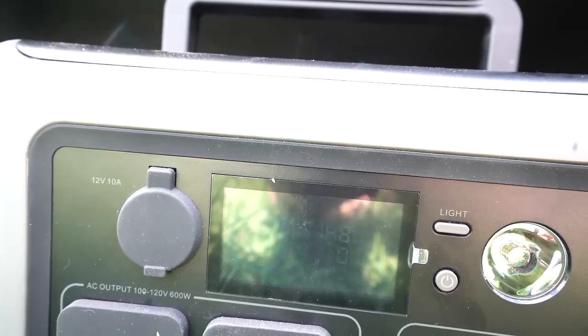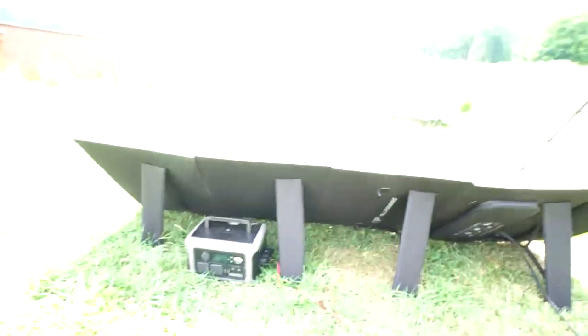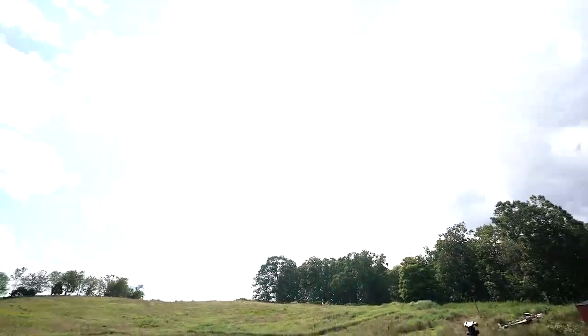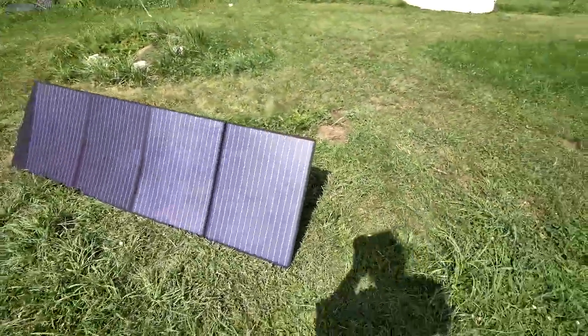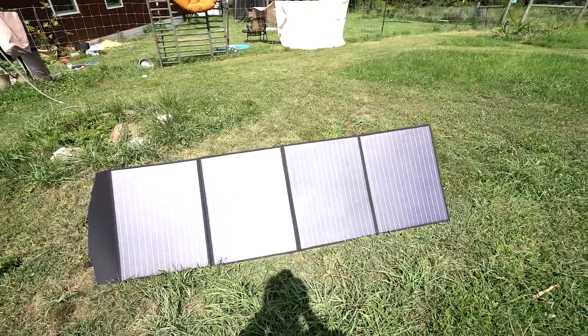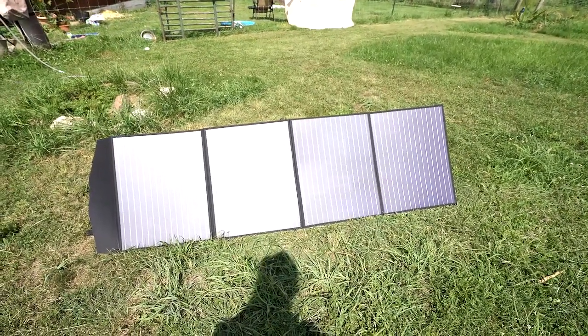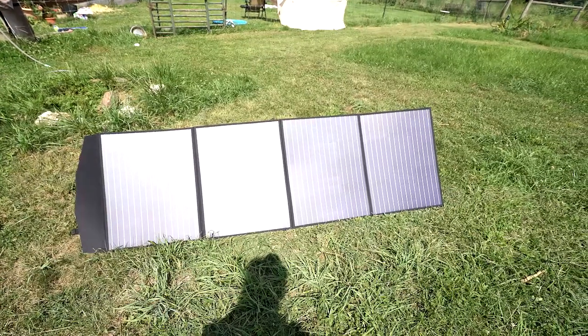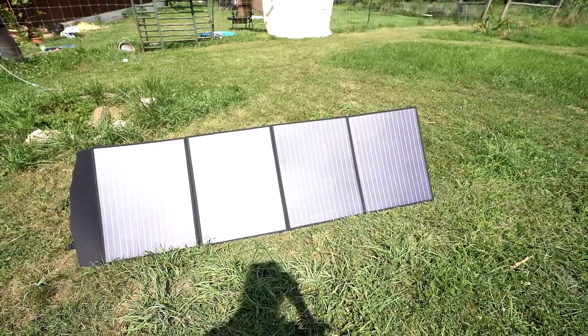It's a little past midday but the sun is out and I am getting 148 watts right now. I've seen it go up as high as 160 watts, and I'm not in California or anything — I'm on the east coast and it is a cloudy day. The sun has popped out from the clouds and I'm very impressed that this panel is giving me that much wattage. That's about the max I would ever expect to see, and honestly I wasn't even expecting that much. It's a 200 watt panel but that's in ideal laboratory conditions — that's how all solar panels measure their wattage. So getting 150, even 160 watts, is impressive.